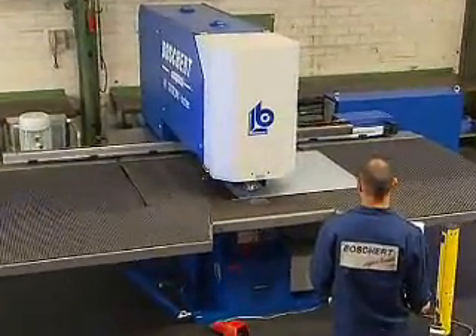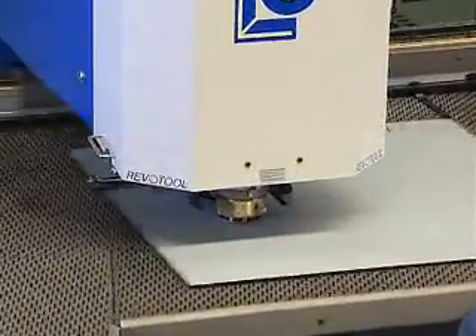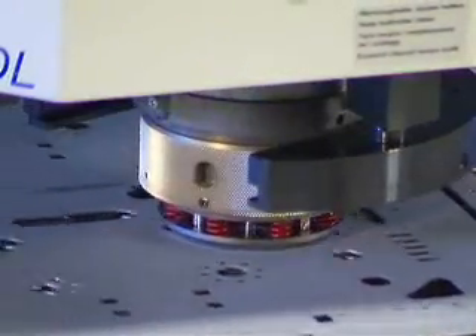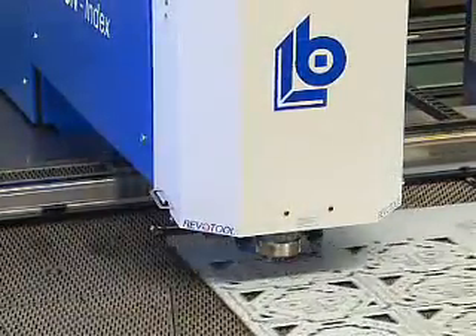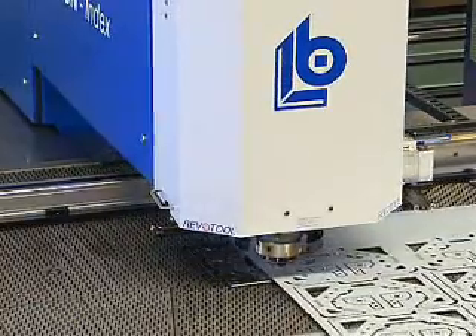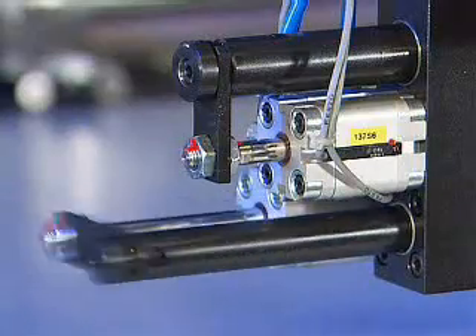The rotation is activated with two brushless DC motors and is controlled separately on the upper and lower side. This maintenance-free system guarantees a positioning accuracy of 0.03 millimeters. The indexing of the tools in the Revo tool is automatic via a pneumatic fixing pin to the Revo tool gear wheel.